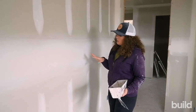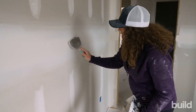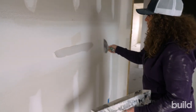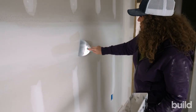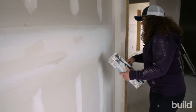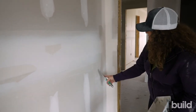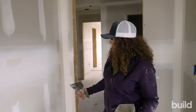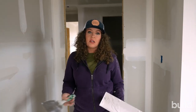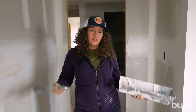For texture, we wouldn't be touching up this much — I'm kind of taking this to a smooth wall level. Right here I can tell there's just a little ding, and I'm not liking the texture of that mud right there, it's a little bit more raised. So again, super tight. There's a little nick right there. Something that will happen at this stage, because we should have already sanded, is you'll start to get a lot of dust in your mud, so your mud will start to get really thick and not so smooth. Don't be afraid to dump it and start over again with a fresh batch of mud.